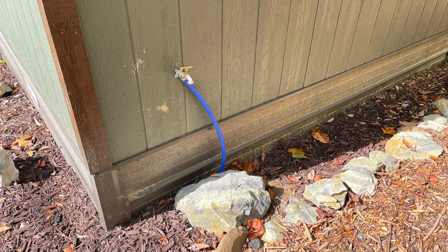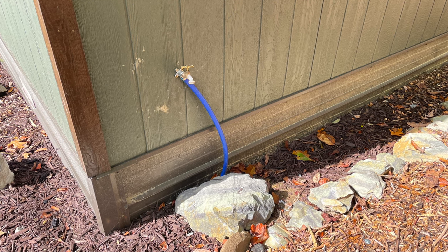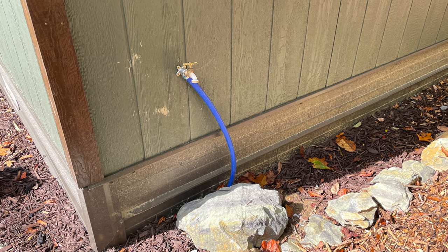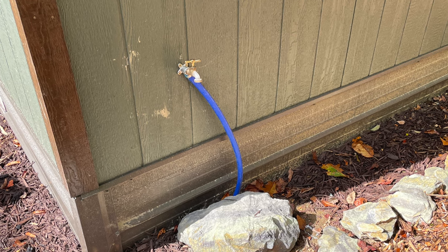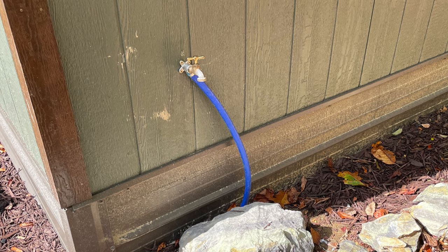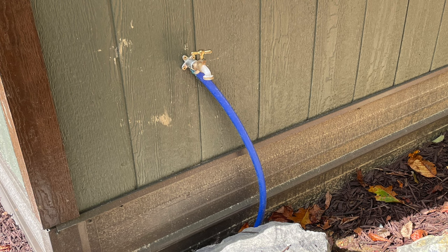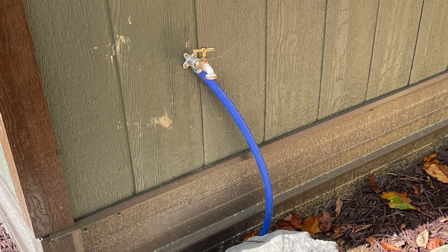And because the water line was buried about freeze line, about 24 inches, not that deep here where I am. You'll have to find out what your frost line is. Sometimes it's 4 feet, so really check. If you're in Alaska, it's probably deeper than that. But I used this special anti-freeze piping. I don't remember the name of it. I got 3/4 inch. It's blue, but it's special stuff. Anybody who knows the name of it, please put it in the comments below in case anyone else wants to share and learn from this video.